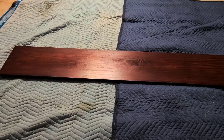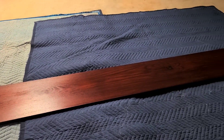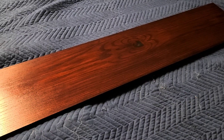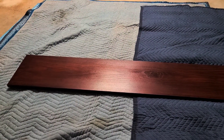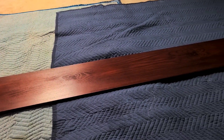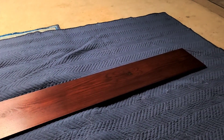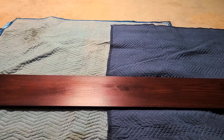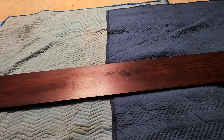Let's take a look at the finish on these shelves — red oak stained with black cherry by General Finish, with epoxy filling a small void. Getting ready to wrap them up and install them probably Sunday. Just wanted to show you guys a view of the finished product: General Finish black cherry on red oak, with a chamfer edge on three sides — that'll be the side facing outward.